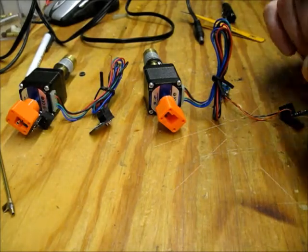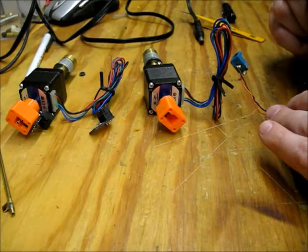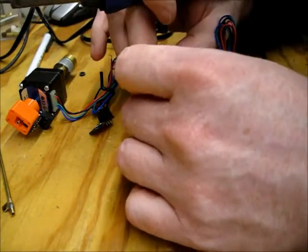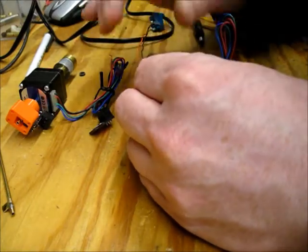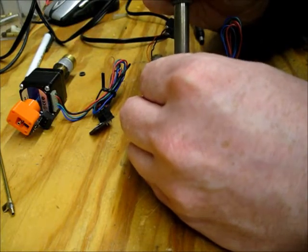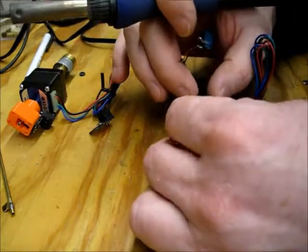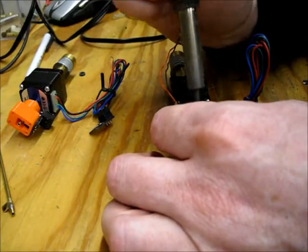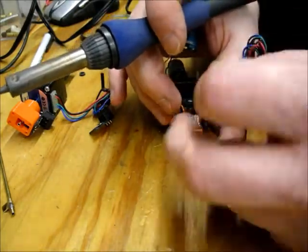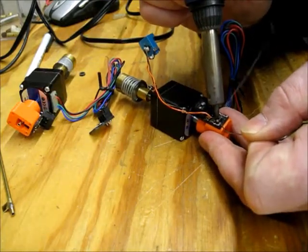Okay, first things first. I need to put some solder on this board. It's heat soaked all the way to the bottom. I need to block the camera and try and line this all up while reheating that pin. I felt it pop on. I don't know how to explain it otherwise. You heat it up, once the solder melts, the whole card just sort of flopped down into place. So there, I'm just making sure it's all the way down. And now we'll proceed around it, soldering the rest of the pins.